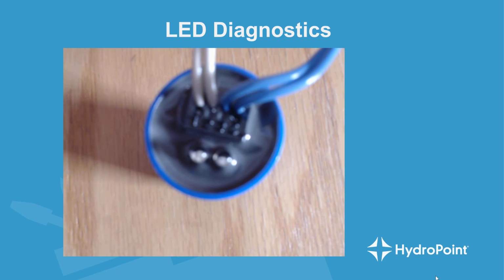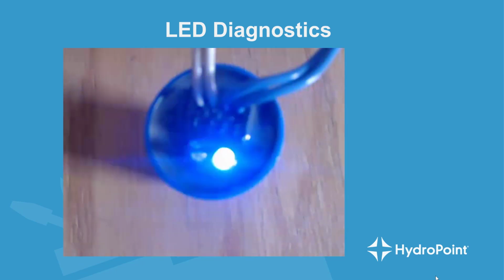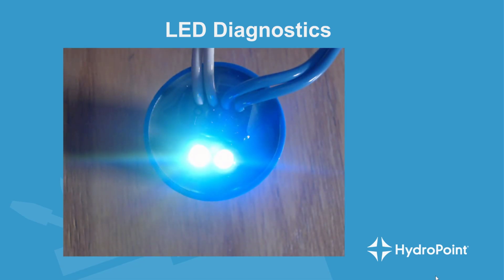Once you've validated all of the LED diagnostics at the CT, the next step is to go check your LED diagnostics at your EXT. If everything is already powered up at the CT, by the time you open the valve box, you'll see the blue power LED illuminated on the EXT, confirming the connection in the network. Then you can use your WeatherTRAK mobile to turn on that station, which should illuminate the green activity light for the valve function, as well as activate the valve.